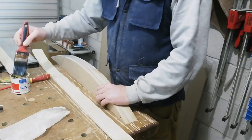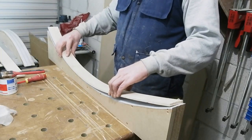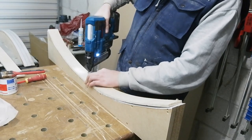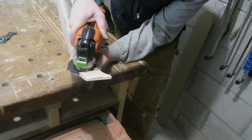I don't wait for the sealing coats to dry — I just give them five minutes to penetrate the fibres, then your actual glue layer will take. Bendy ply in place, I pin it to the MDF, making sure all the pin heads are well buried. On the male piece, I cut off the excess bendy ply flush to the back.